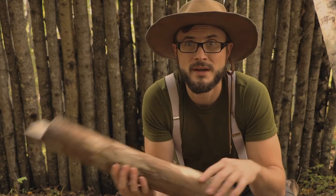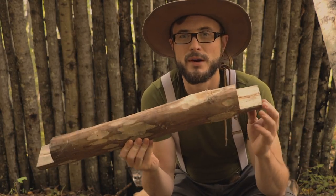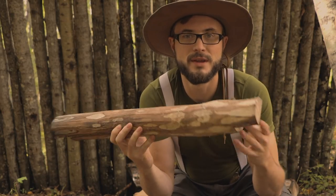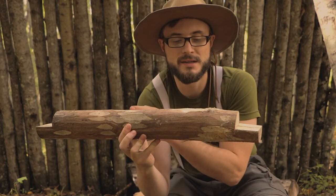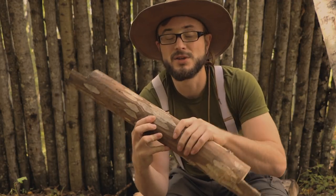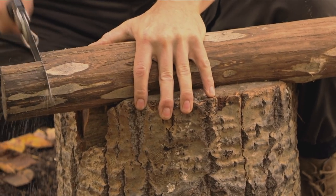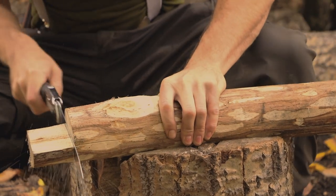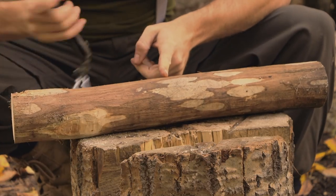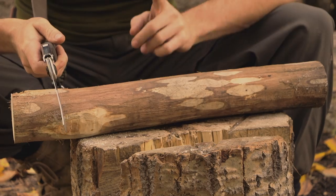I really want to be working with dry wood because drilling holes in wet timber is a nightmare, especially with that spade bit. I found a nice piece of poplar that's been kept dry under our treehouse since we made the coffee table — this is just an offcut piece. I'm going to cut it to get a flush end, cut it to the length I want the latch to be so I can get two pieces out of it, then split it and start carving it down to make my latches. I'll cut it straight in half.